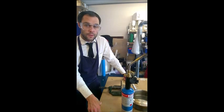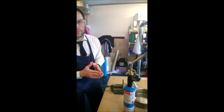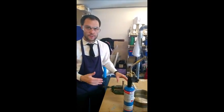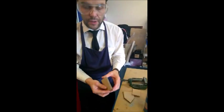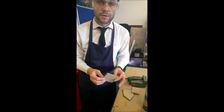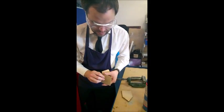We're going to do a video on pewter casting. I'll go through some health and safety stuff and we're going to try pewter casting into a mold. The mold is made out of card — we can use card or MDF because pewter melts at a relatively low temperature, around 230 to 300 degrees.